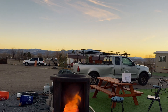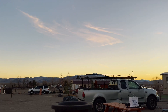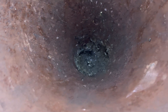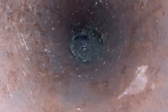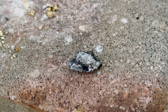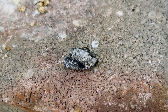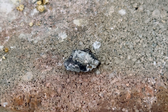The sun is starting to set here in Stagecoach, Nevada. We have a bit of success — I did get the cone mold up to 1,000 degrees and I was able to break the top layer of pyrite to get to the molten lead inside the cone mold. I was able to chip away some of the pyrite and lead off the cone mold, and I'll add in some clean flux and try to burn the rest of that material out.